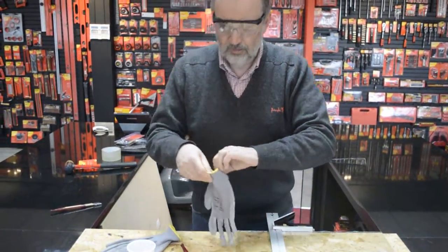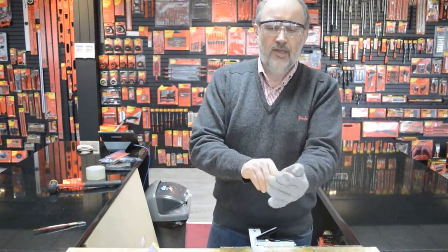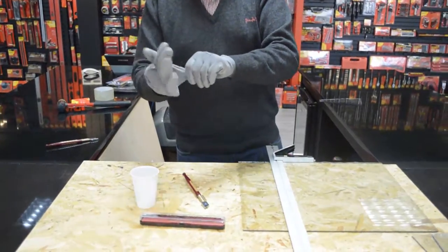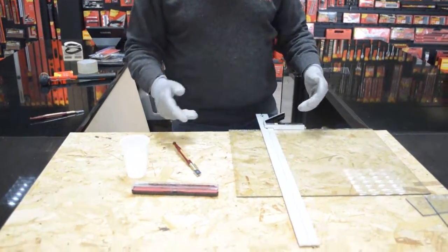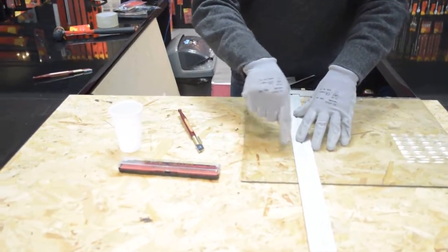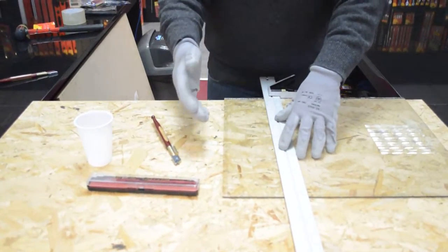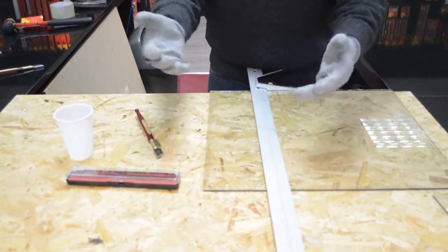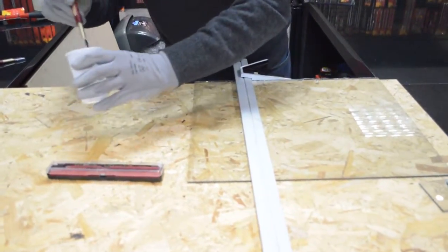Because it's glass, I'm wearing safety protection. I'm wearing a pair of Amtec cut five glass-cutting gloves. I'm cutting glass and you never know — depending on the stresses in the glass or how long it's been stored — it could suddenly go off at an angle and fracture across. So I'm wearing these for protection.